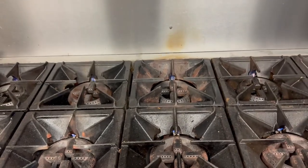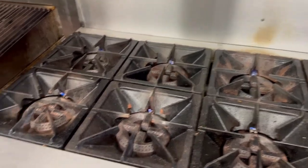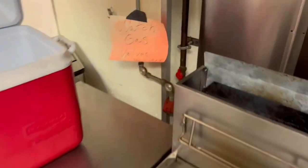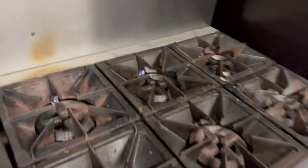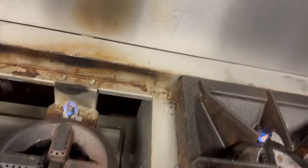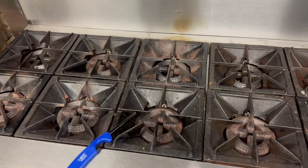When you're done, all you have to do is go ahead and turn off the gas valve in the back. You may find it easier to go ahead and just turn off your main gas valve. That way you're going to stop any pilots going and let it cool down. Then make sure you get back here, remove that burner, and move the valve from straight up and down to perpendicular. Now it's off and pilots are out. Both gas valves are off — you don't have to worry about any gas leaking from the stove once you've shut it down.